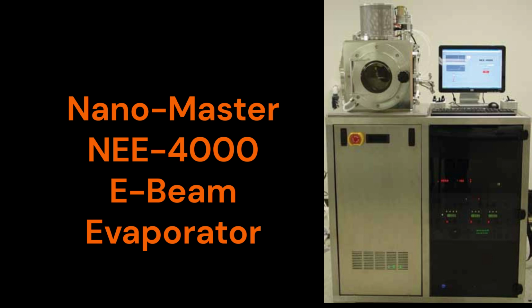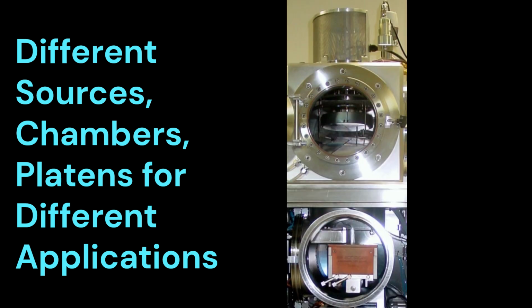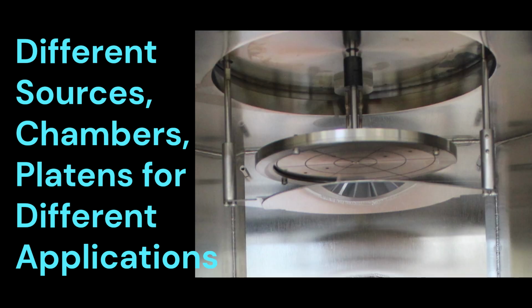a secondary chamber is provided for housing the E-beam source. This configuration can be provided with a gate valve between the two chambers to be used as a load lock to keep the E-beam source and the evaporation pockets in vacuum, while substrates are loaded and unloaded from the main chamber. For applications where automatic loading and unloading of wafers are needed, a third load lock chamber is attached to the left face of the cube for another load lock.